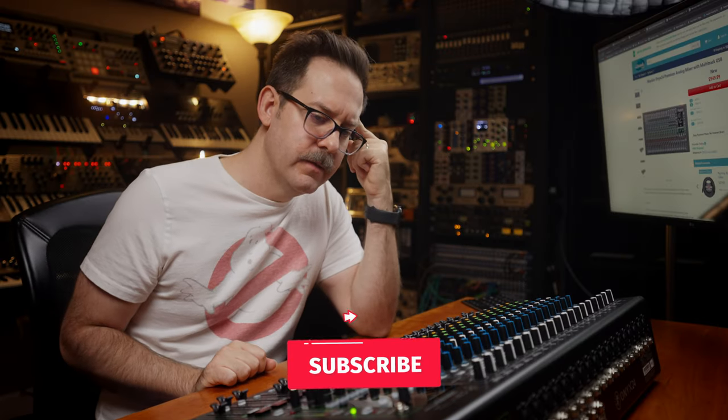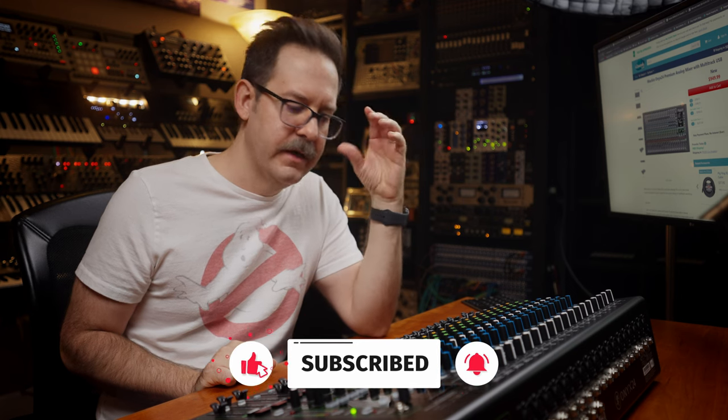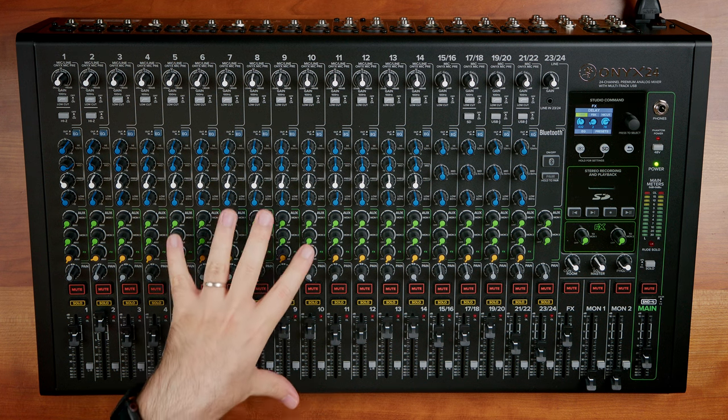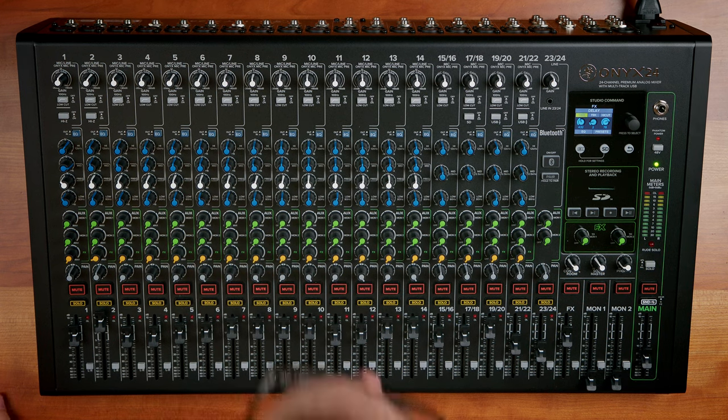This is one of these things though where the routing really falls behind the previous Onyx line, or the one that I'm using, the 1640. That one has 6 auxiliary sends, and that also means it's got the stereo returns. I think it has 4 stereo returns on there for the previous 1640i. So that's missing on here. It doesn't have a ton. Actually, how many stereo returns does it have? Yeah, so this does not have any stereo returns.